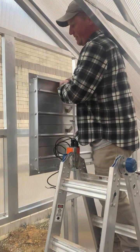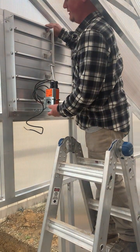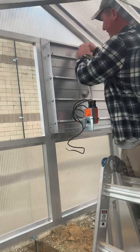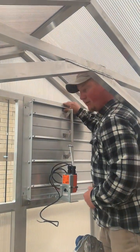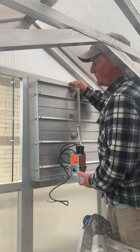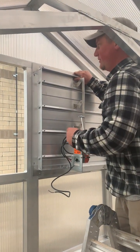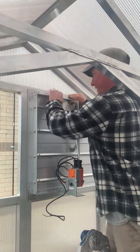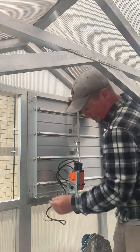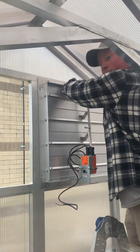Pull it out of the box and set it up in the opening. I like to take one hand and put a thumb in there, then put my other fingers right on top of the opening so I can squeeze and go up and down. Basically you're looking for an even reveal — that's the easiest way to do it. When I get it up, I see the reveal on the top matches the reveal on the bottom and the sides.